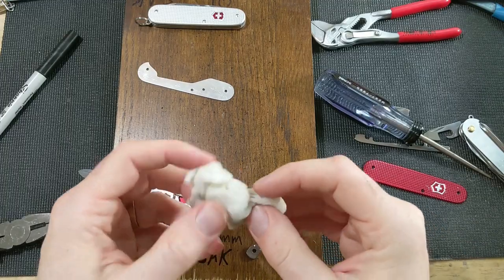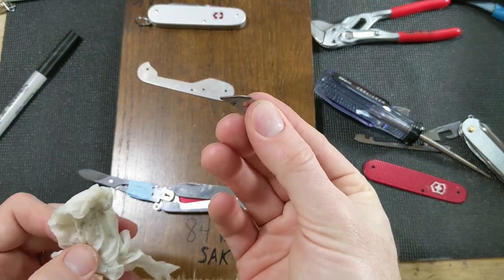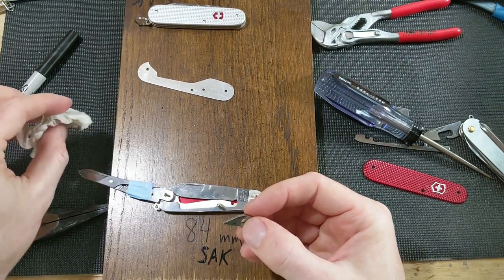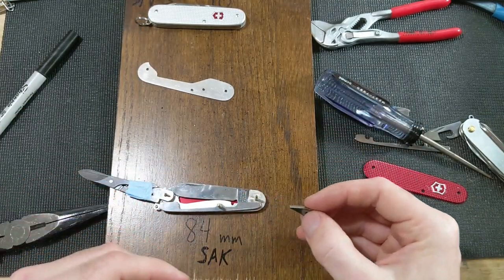While doing that cutting and grinding, you probably saw me touching this paper towel that I dipped in water onto the little piece there. You probably want to do something like that yourself. Just a little dip of water and then rub it on there, a little cut or grind. That'll just help keep from overheating the steel and blackening it, which would weaken it.